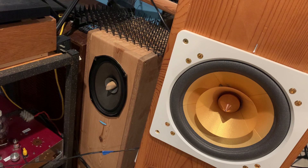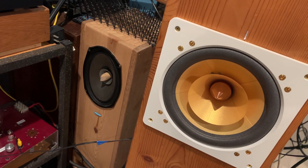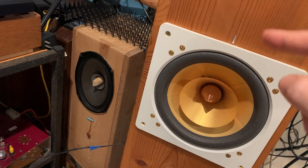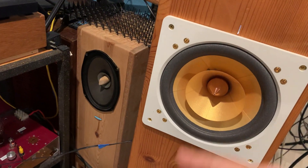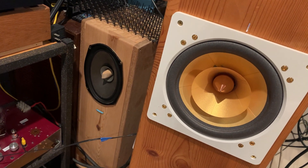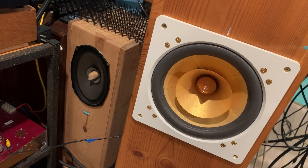And because of that, if you have a multiple driver loudspeaker — let's say a two or three way — then you need to be cautious that the jump in efficiency might be different for your tweeter compared to mid-range or woofer. And then, after it breaks in, you might need to adjust your crossover to balance them out.